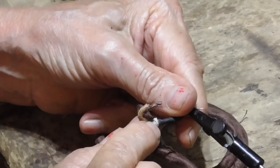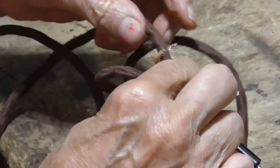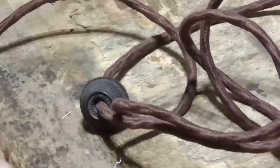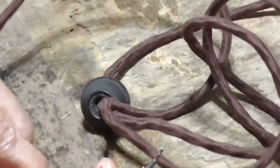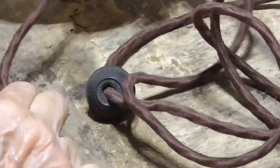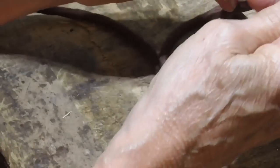See, I can get to the wire here, the fine wire, and I can see that my connection is good onto that fine wire. So it's going on up into here where the break is. That means that the break is somewhere in the length, because we know this one's good too. I'm going to try wiggling it. I've measured this before, and it was measuring. So it's very close to being working. If I can find the place where the break is, then I can splice it.